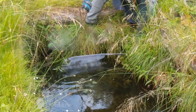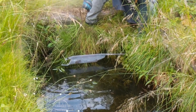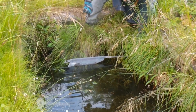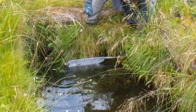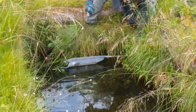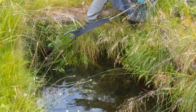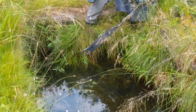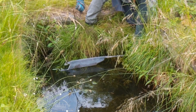Literally, last year I ruined a draw knife's blade in exactly the same way. Instead of relying on a self-normalizing phase, I stubbornly continued to cool the cutting edge in water. As Lewis Carroll wrote in Alice's Adventures in Wonderland, if you drink much from a bottle marked poison, it is certain to disagree with you sooner or later.